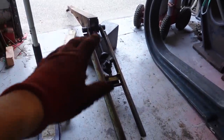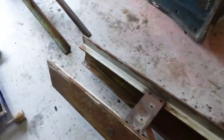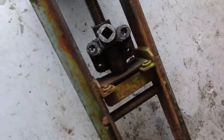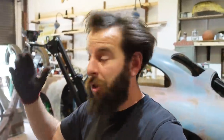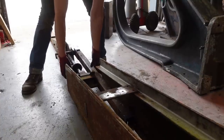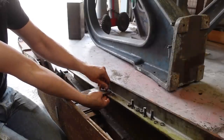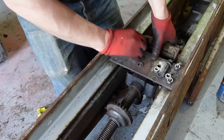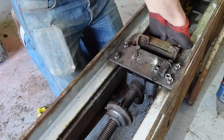Now we can get up the good end and try to get that mechanism with the adjusting wheel and that threaded bar all back together again. The arm and the upright mechanism for the crane - I need to flip that over, slide it in here, and then line up the bolts and get these four bolts through that plate. Then I'll be in a position where I can actually stand the thing back up again for the last time and get this hand wheel bolted on - we're nearly there.